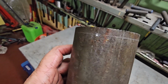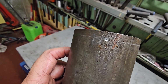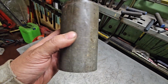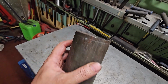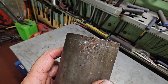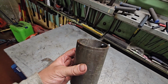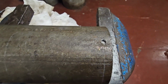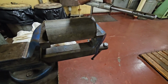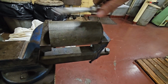And I've sketched a little line. Here's my next hole, is going to be right there. I'm going to drill it for a 5mm screw right on that line. I got it punched right on the center. This is 13 centimeters tall and 7mm from the little line there to the top. So I got my punch right in the center of that, 180 degrees from this one. And then we'll see. I'll show you what it looks like when we install them. Five 5mm threads.